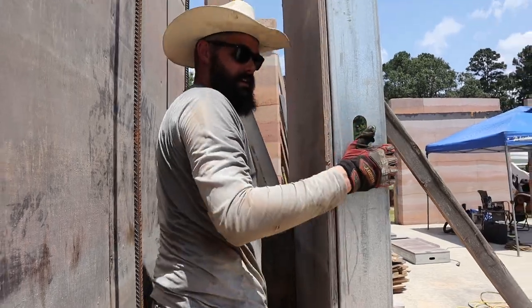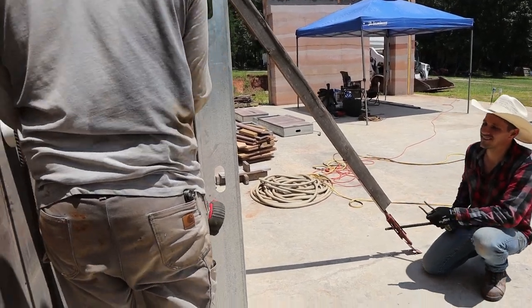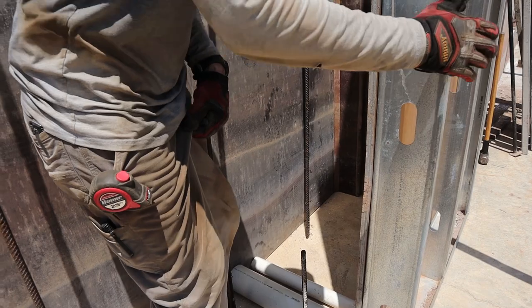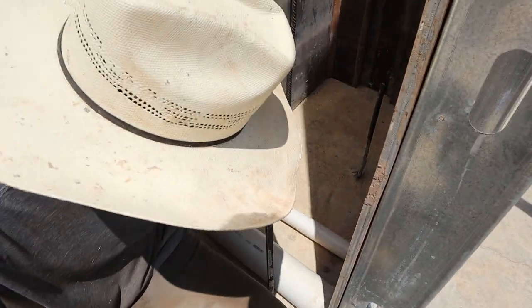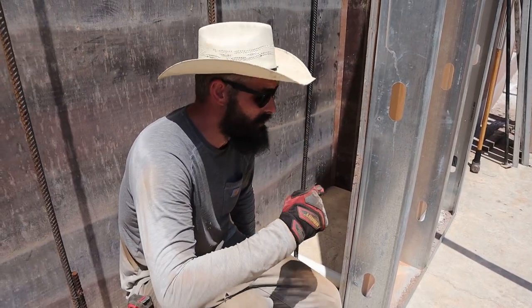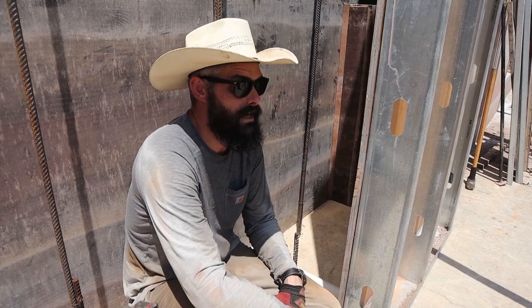You know those days when it's so hot you can't think? We got the drain line in. We separated the two pipes a little bit so that rammed earth can pack in real tight in between them. There'll be a little bit of rammed earth there — we'll have to clean up the outside but it'll be okay. I just thought of why the drain should be on this side and the water main on that side: the drain is going that way and the water main is coming from that way, so otherwise we'd have to crisscross them outside. We are better than that.